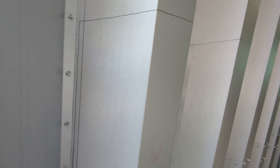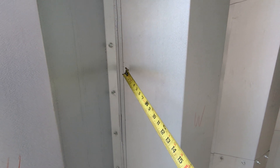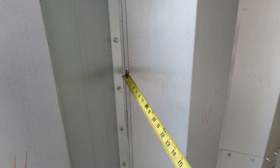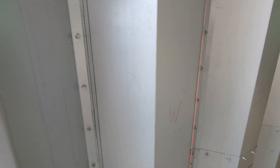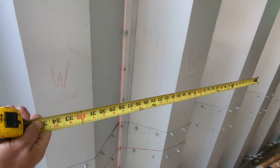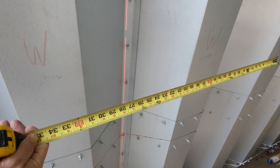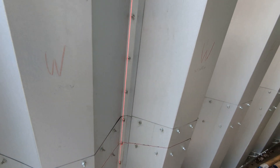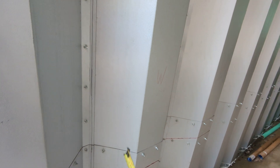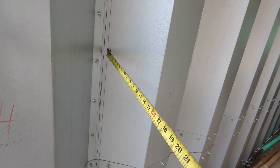I used that 41-inch diagonal measurement to get where the top line is, raising the laser level to get a nice straight line. On the sides, it's more difficult. That is a 45-inch wide opening, so we put the tape at 22 and a half inches to eyeball the center, and once we figured out where that went we were able to cut it.